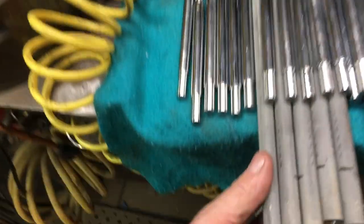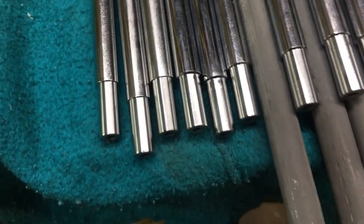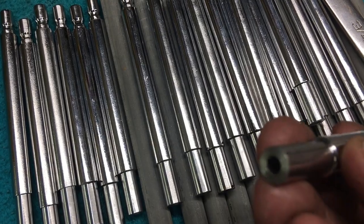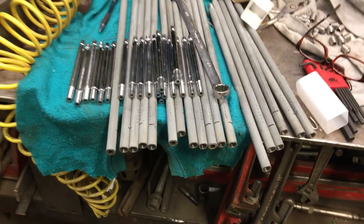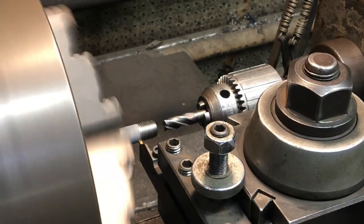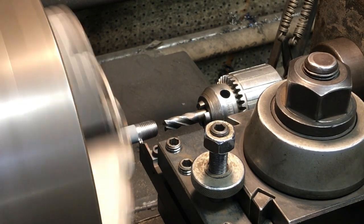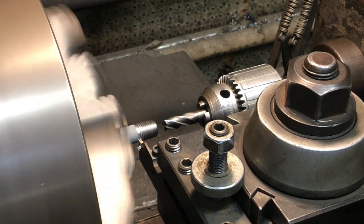The bottom probe ones are hard so they don't wear out where they plug in and out of the coupler. Here I'm just showing where I cut the one end off that was threaded. Those ends are already machined off, and I'm using a part-off tool cutting off the threaded part. Then I'll just go in and bore the hole using an end mill.